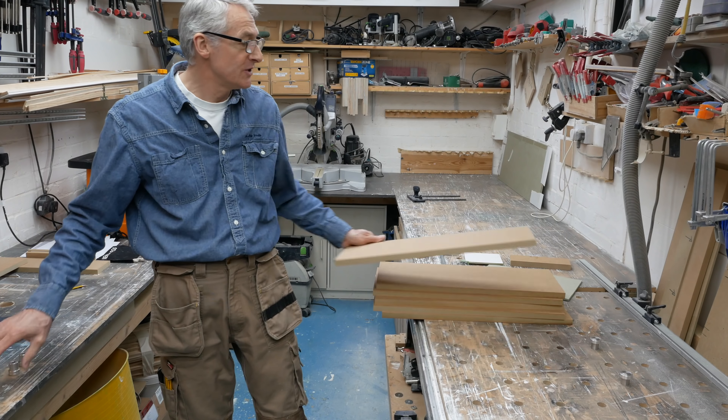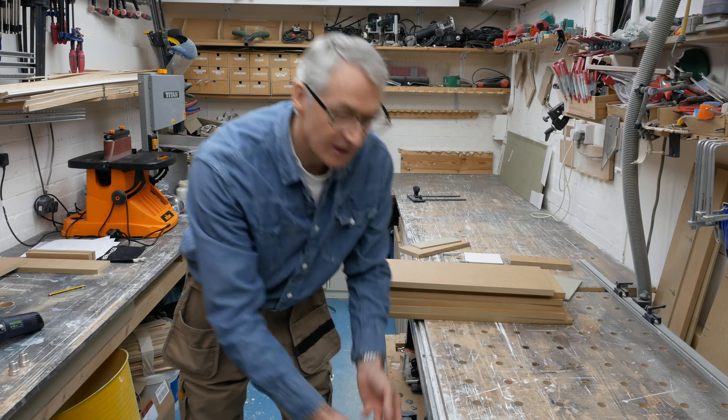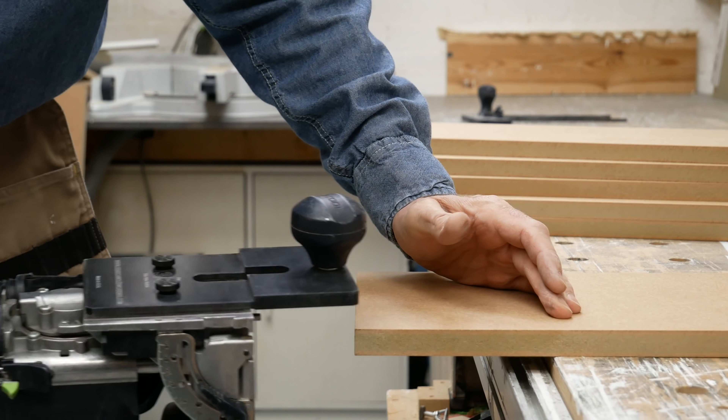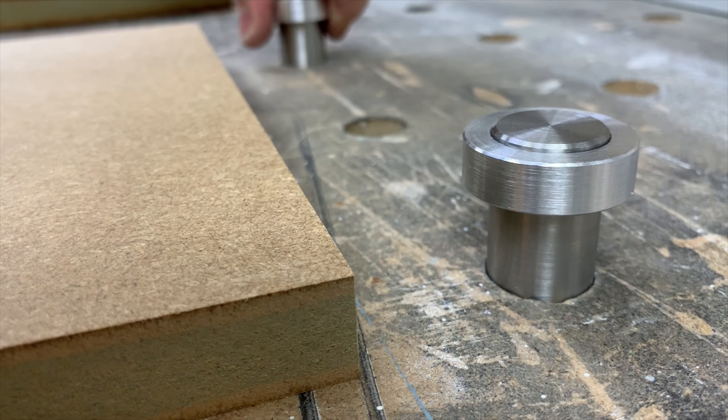And when you're finished, one twist and they're away and stored safely. So there we are — not really the intended use for these little bee collars with the super quad dogs, but that's my killer use case for this combination: to provide the back edge, like clamping effectively, for workpieces that hang off the front of the bench. This has been a niggle of mine ever since I discovered that the weight of the Domino and the downward pressure would actually make the workpiece tip up. And these have provided such a neat, elegant solution — no more messing around with clamps or finding bits of scrap.